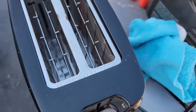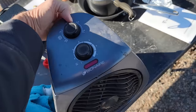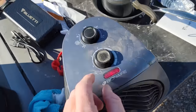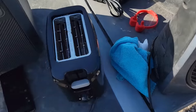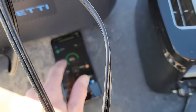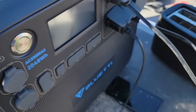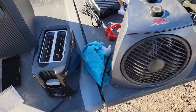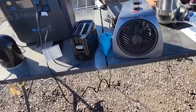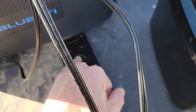Let's try a space heater. By itself the space heater might use enough power to trip the system. On low it's drawing 1,500 watts out while we're only putting about 300 watts back in from solar, so the battery is going down. The cooling fan on the unit has turned on, so we are working it hard. But I'm pretty impressed — we've got a space heater going, a toaster going, and a fan going — basically an entire kitchen and heating setup for a tiny home. The toaster just popped and we've only lost 1% of the battery.